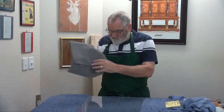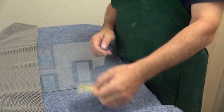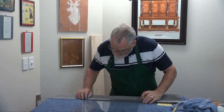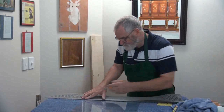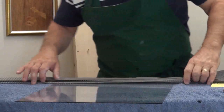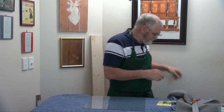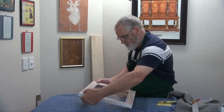Wash my hands — got most of the wax off, because I didn't want to get wax onto the glass. I've got my measurements, I've got my non-slip mat. First thing I'll do is measure the long line, which is 363 mil. Got a glass cutter here — my normal glass cutter is actually down at my other workshop and I thought I'd buy one of these cheap ones online. They're two bucks — don't. They're rubbish. What happened was I filled it full of oil and as soon as I did, all the oil dripped out and went everywhere. But I've got it now so I might as well use it. You get what you pay for. One bit — save that for a job later on. Just make sure we're the right width, which we are.